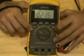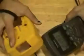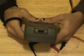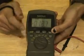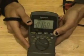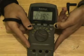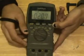It also has a really cool hold button. So if you're measuring frequency or anything else, you can hit hold and it will lock the value. It's got a nice four-digit display and a rubberized body, so I've actually dropped this thing from quite a height and it's taken quite a beating. It also has a serial port — not an absolute necessity, but I like it a lot. The PC-side software (Windows only, though I believe there is homebrew Linux software) allows more precise measurements, giving me six, seven, or eight digits on readings instead of four. It also gives a rudimentary oscilloscope function so I can physically see waveforms, and allows me to log components — so instead of writing down in a notebook what each resistor is, I can label them in the log file.